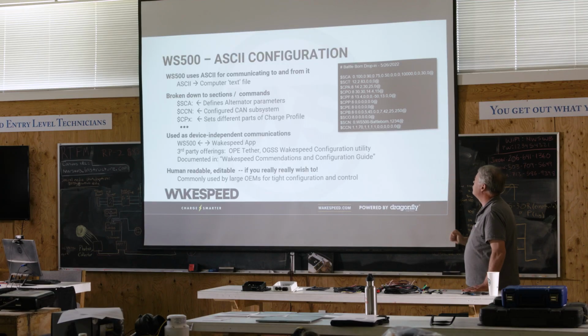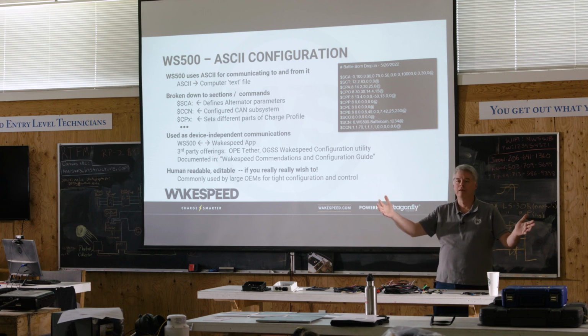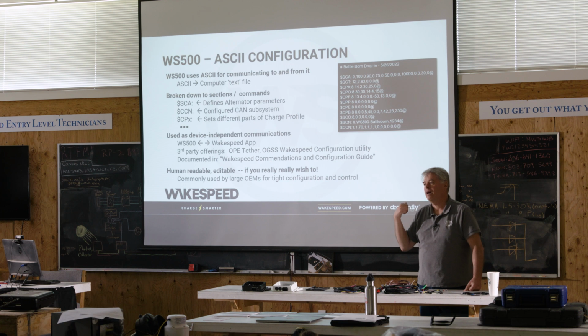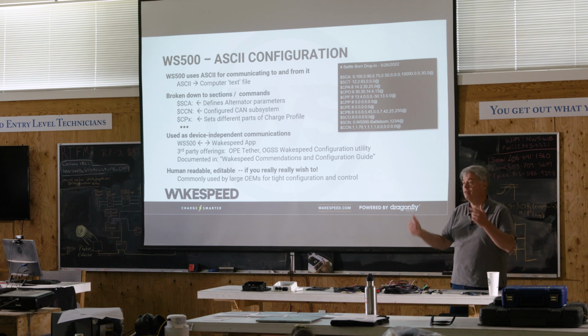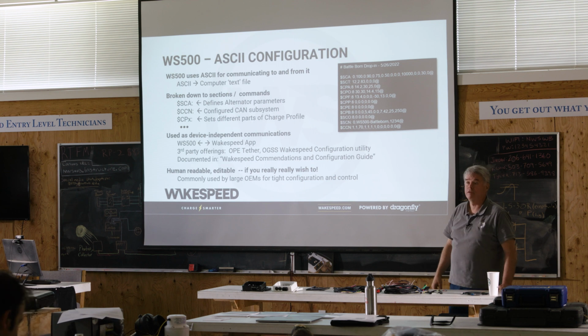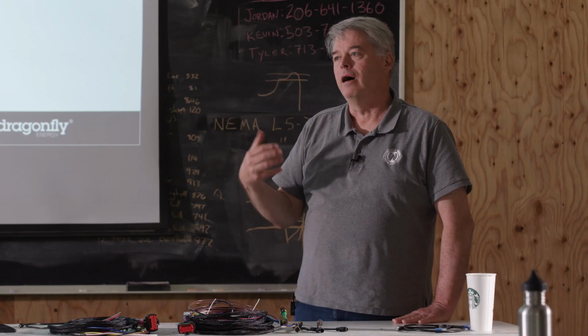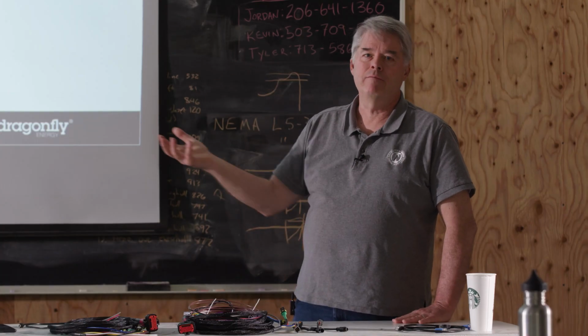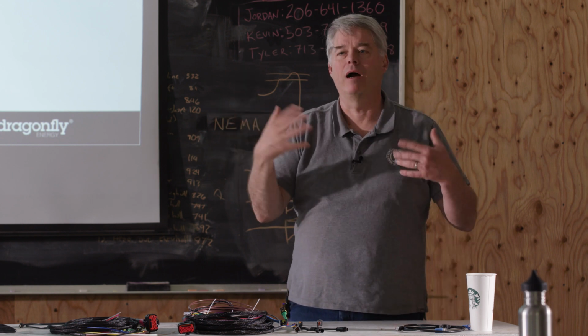What we have done here is we have the ability to say, when these batteries are getting stressed, they're reaching their upper or lower limits, or if they're highly discharged, we'll take it gentle on the battery. Even if the battery asks for more, we'll take it gentle. We did that because sometimes customers, when they design their system, just don't want to put the battery to its limit. They want to take it more gentle on the battery, just like you can define the lower temperature point on the alternator or lower maximum field drive on the alternator. Other times customers may say, the battery may be able to take 400 amps, but the rest of my wiring can only take 200 amps. So that's kind of why we left that active.